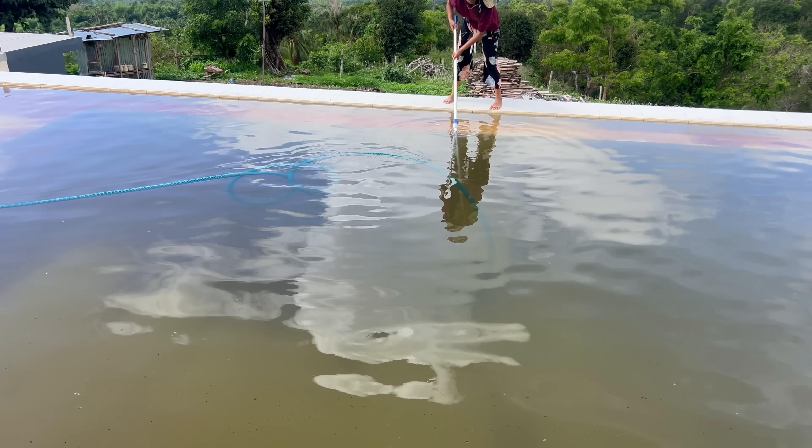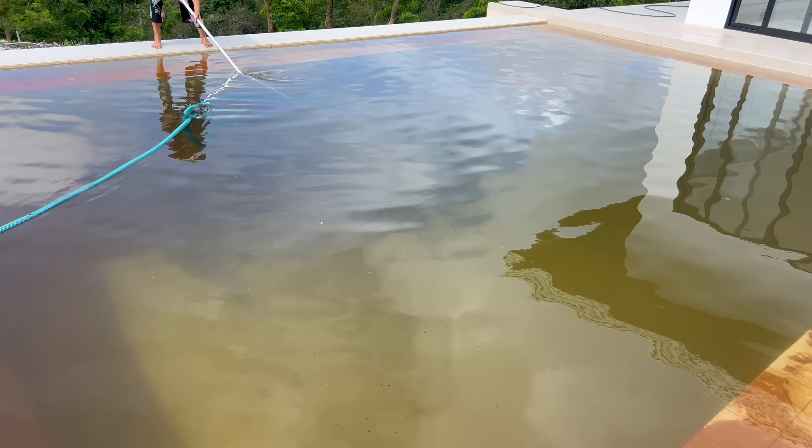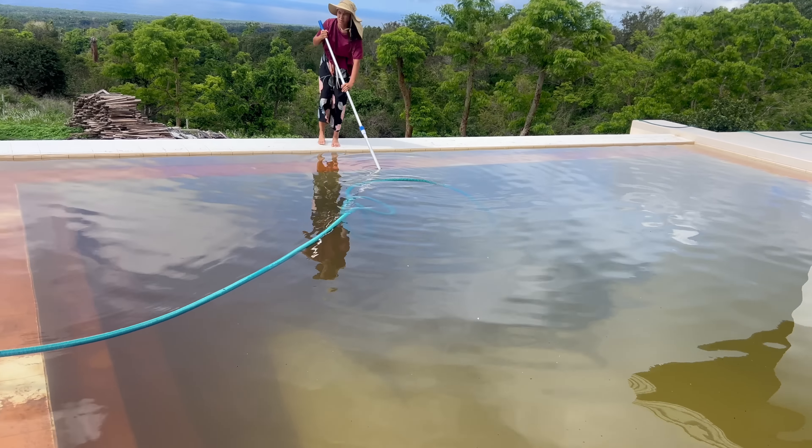You might be asking why did this happen — why did the pool turn bloody red? It's quite simple: it's the metallic ingredients in the source of our mountain water. It is so high in minerals, mostly iron, perhaps copper and magnesium, that once you do the initial chlorine treatment, it oxidizes with the iron and creates rust — basically it's rust.